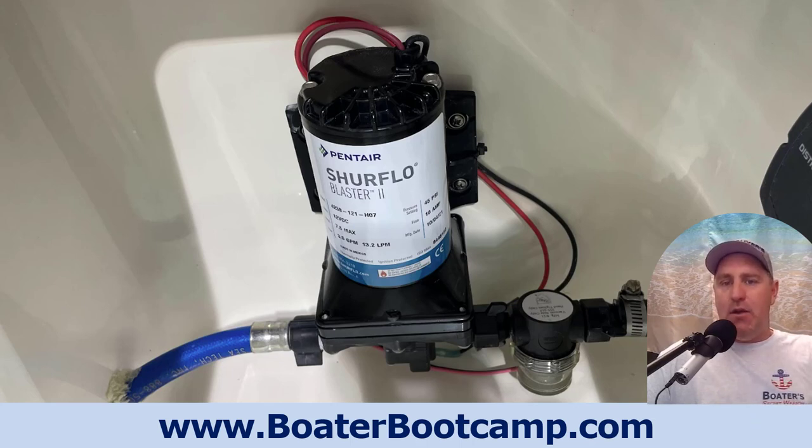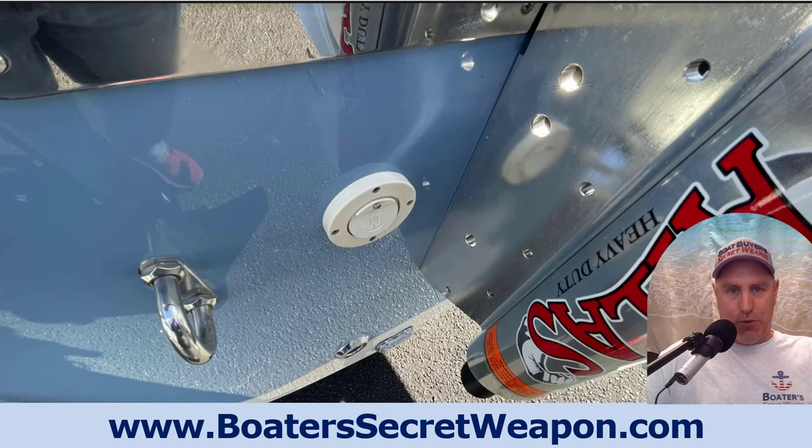And so if you ever find that your water system isn't priming, you might want to check that little cup, make sure water's getting in there, make sure it hasn't got clogged up with a bunch of gunk and algae and growth and things like that if you don't use your water system very often. And it's real easy to clean out, and that's where you can get it reprimed as well if there's an air pocket that's not getting through.